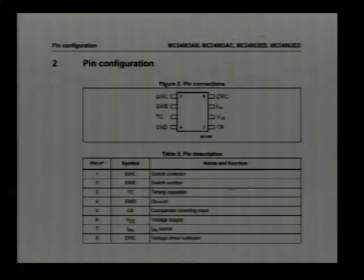So what can you do with that, right? Here's a typical one. This is an MC34063. It's a really common voltage regulator. Every dumb $3 iPhone charger that you buy at a 7-Eleven is going to have one of these, and lots of expensive parts have them. It sells for about 15 cents in quantity. It's a switching power supply regulator. So this little diagram out of the data sheet tells you what every pin does. That's pretty handy.